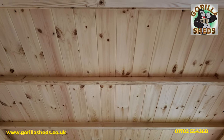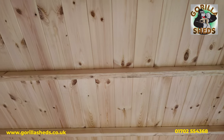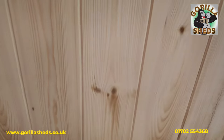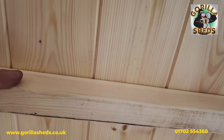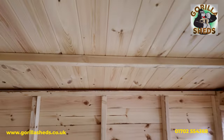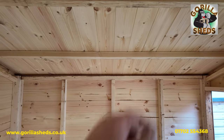The roof on this is 12 millimeter tongue and groove. That noise you can hear is David putting the staple and hasp on the door. So you've got 12 millimeter tongue and groove on the roof, and you've got these, oh, bloody camera's pointing upwards. You've got these 45 millimeter by 32 millimeter battens. They're just to tie the roof together. The strength for the roof is in the planks going that way. These battens here are just to tie it together.